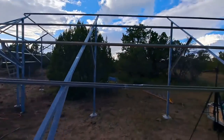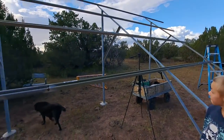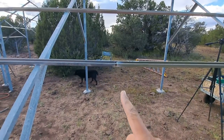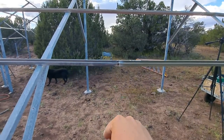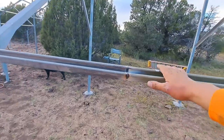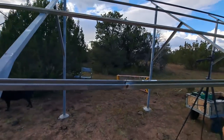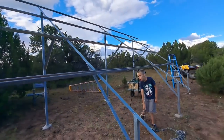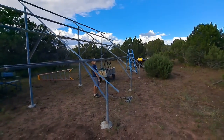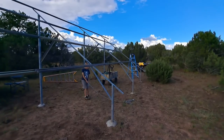The strut is all welded on. There's just one little thing that's bothering me — at this weld right here, the strut is bent down. That's probably partially due to the heat from the weld. You can't really tell from right there, but if you go over here you can kind of see it's dipping down.